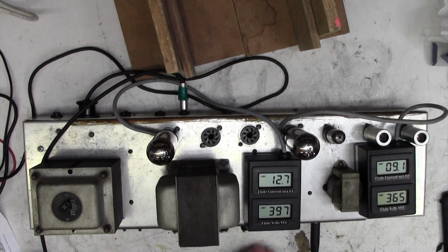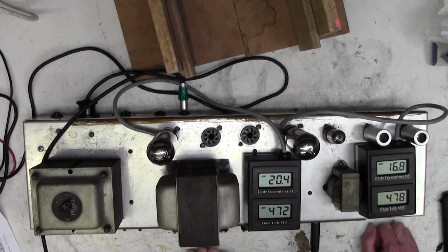Alright, well, let's carry on winding up the input voltage, see what happens. Oh, the hum went up noticeably when I went up a few volts here. Now I'm up to 200 volts on the input, and there's a very noticeable hum on the speaker. It's biasing up nicely though, there's no problem there.